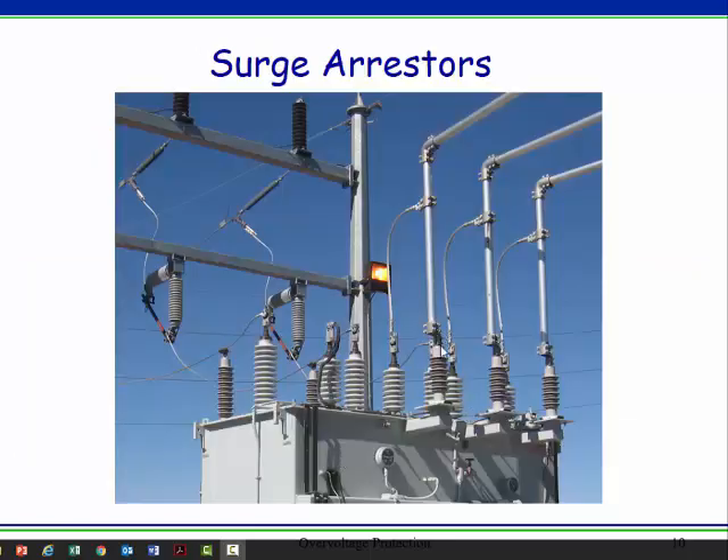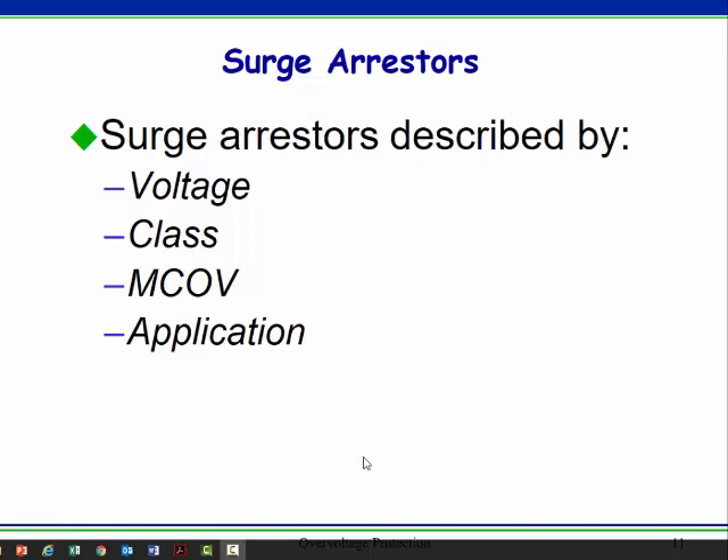What do they look like in the substation? Here are the surge arrestors — you can see several of them. A transformer has tons of insulation and is a very important piece of equipment; it might be a half-million-dollar unit, so we're trying to protect that insulation from overvoltages. Notice that the buswork comes straight down into the arrestor, giving it a really good path. The way we connect these impacts the voltage that the protected device will see — the better we connect it, the lower the voltage.